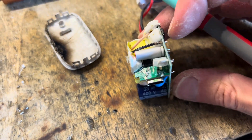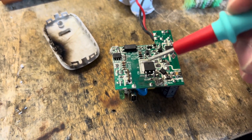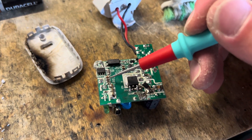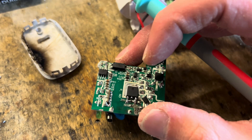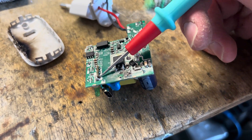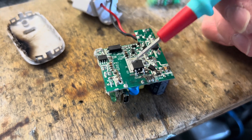I checked the secondary capacitor right here, and it's showing a full short. I actually don't know if the problem is on the capacitor or some of these ceramics that sometimes, due to manufacturing defects, go short, or if it's on the USB-C controller board. The soldering on this is not really the best — here there is not enough, here there is too much. It's not really all that great, but an interesting failure mode.